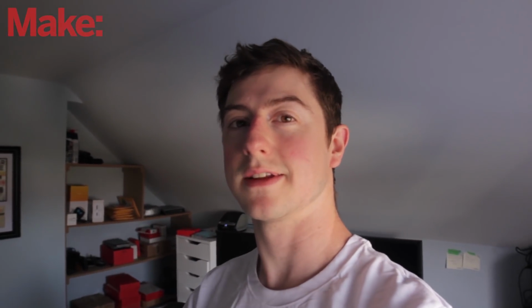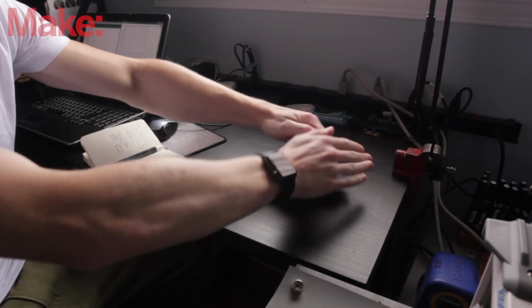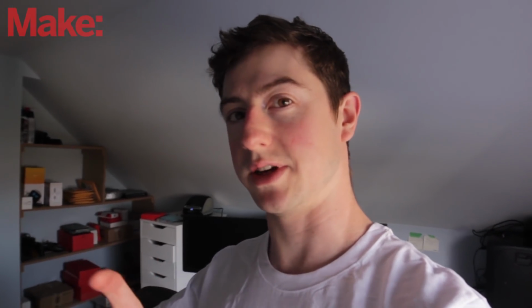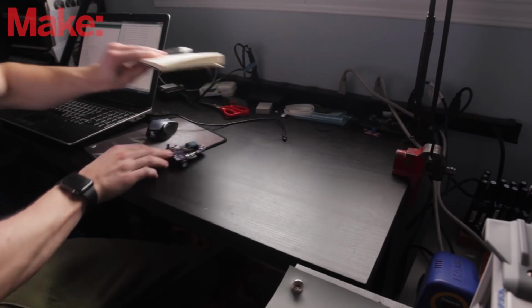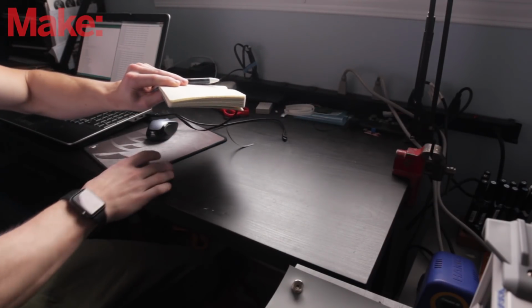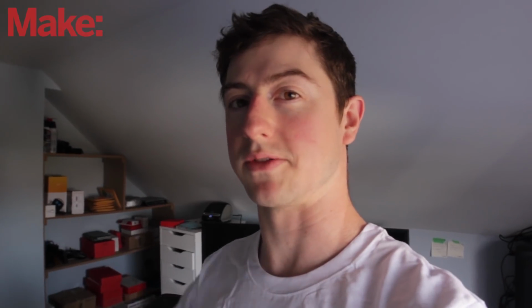Now if we were to train it again, it may behave differently, because each time you train it, the equation that maps the inputs to the outputs is slightly different because the beginning is random. So that's what's really cool about neural networks. Now you can also experiment with, like I said, removing some of the training inputs, having larger gaps between the extremes, so that the behavior could be more erratic, or it doesn't actually want to avoid shadows. It could just drive around in circles. You know, anything could happen because it'll be less defined about the different amounts of light it could see.